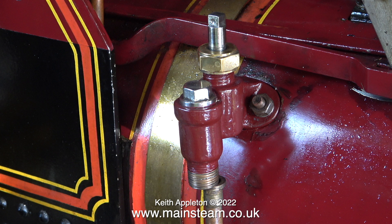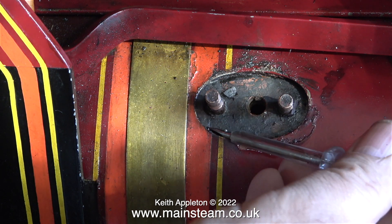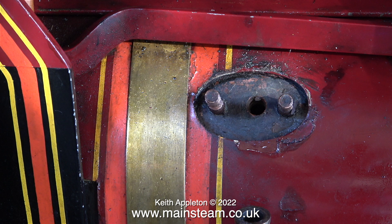In the case of this particular check valve there is a bit of a problem with the alignment of the shutoff valve internally. I need to make a modification to it. The first thing to do is to remove it from the engine and clear away any of the pieces of gasket that are left behind.